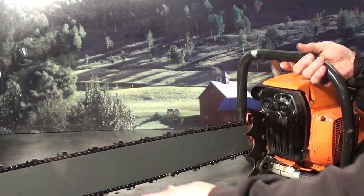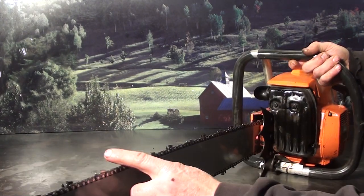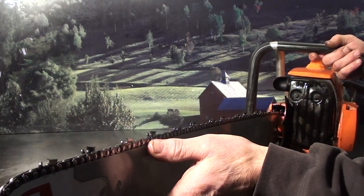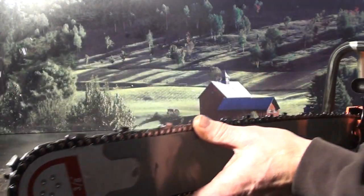That's a used 32-inch bar with a new tip in it, and that is a new chain, 3/8 pitch. Skip sequence, skip being the spacing. Chisel bit, square tooth, 63 gauge. And there's that new tip. You can see that.